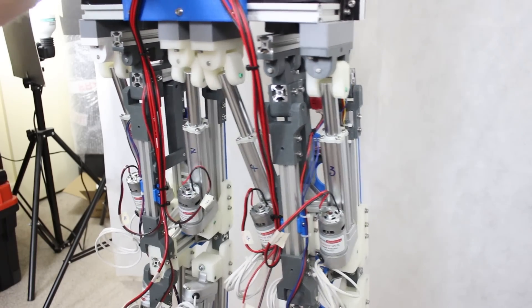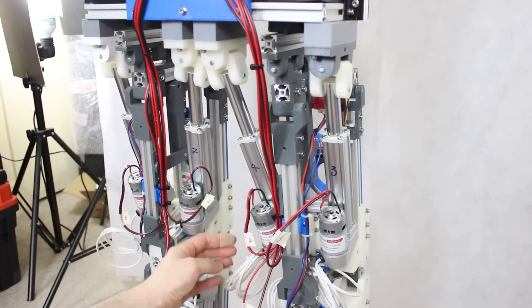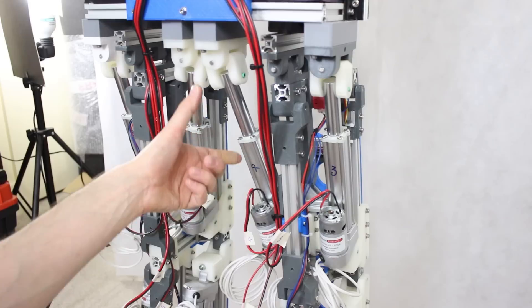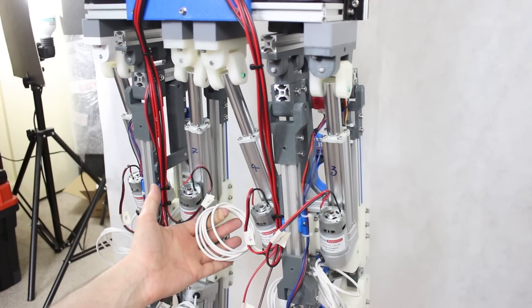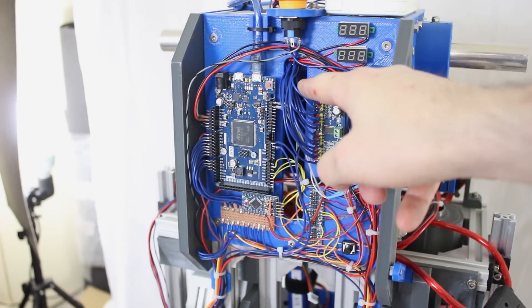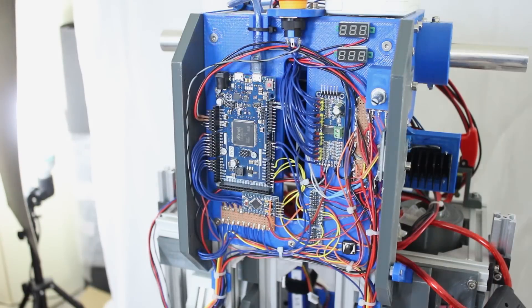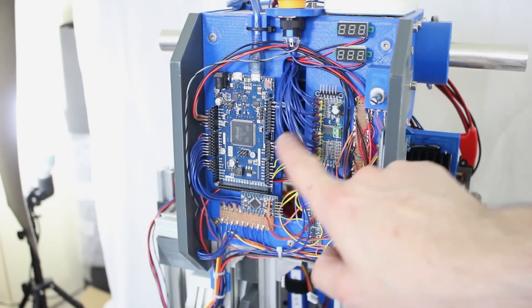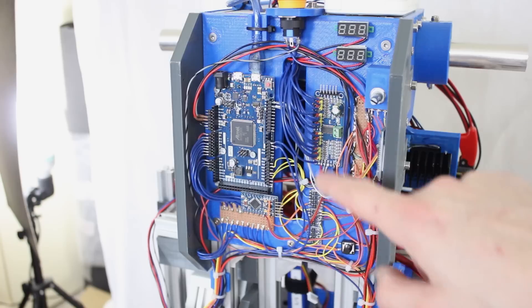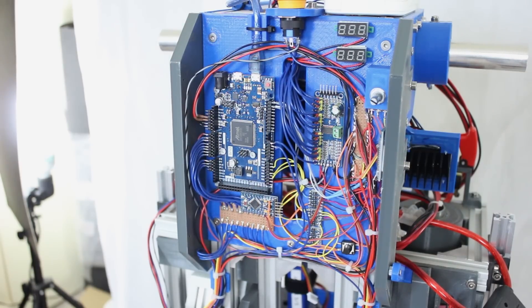All the actuators are fitted. This is feeling a lot more rigid than it was. There is a tiny bit of wobble but it just feels much more solid with that wider bracing. I've used the existing power wires to wire to the motors. I've got these white wires as well on each actuator which are actual limit switches built into the actuators. Those are going to get wired to the electronics so I never run the end stops. What I'm going to do for now is just break the PWMs to each side of the motor driver — there's one wire for each direction on each motor and one switch in the limit switch for each end of the actuator. I should really add some additional logic so I only use a 5-volt signal from the switches, perhaps an AND gate, but I need to do some changes to the controller in the future, so for now I'm just going to do it the nasty way and break the PWM signals.